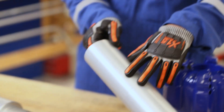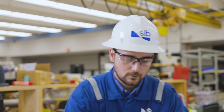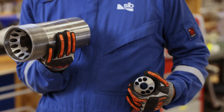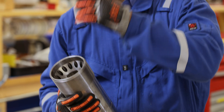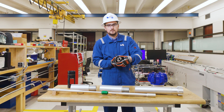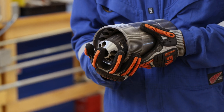Next comes the hangoff sub. The hangoff sub goes above the bit, and crucial to the hangoff sub is the landing ring. The landing ring has holes in the middle of it to allow flow to go through, but at the same time stops the tool string when it lands. Important to note here is we have a large cross-sectional area that allows circulation throughout logging operations.